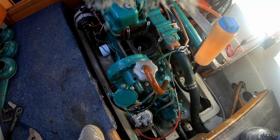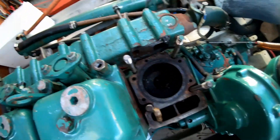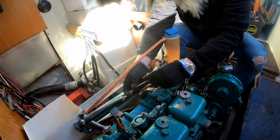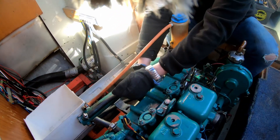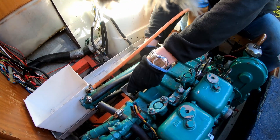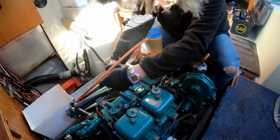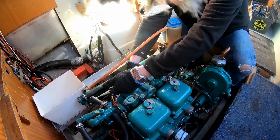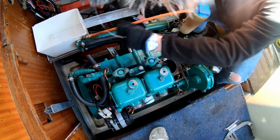Come on, let's get inside the boat. Here you can see the MD70C — one of the heads is removed. There's quite a bit of soot and other debris in cylinder number three, where the accident happened and the valve jumped down. What you can see Anders doing right here is removing the exhaust connection to the cylinders. On the MD70C there is coolant water going through this, which makes sure the cooling system in the cylinders is water-filled while the engine is running, and then it drains back out to sea.